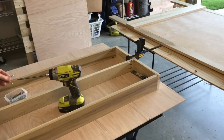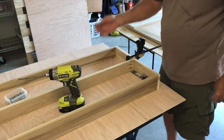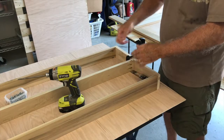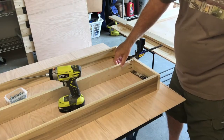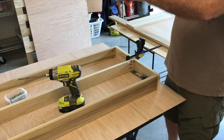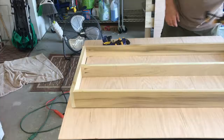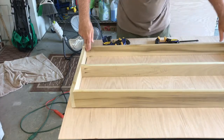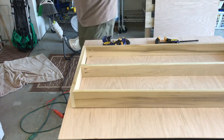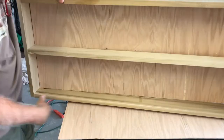Okay, so this technique is to do our stair landing. I'm assembling it upside down because I have my plywood support base and then the wood floor upside down. I've trimmed this piece of 1x4 to where it'll just allow the wood flooring to sit just below the edge of this on the other side. This is the right deal, the support will be fine, then we'll come back in and put the legs in. It'd be easier doing it this way.